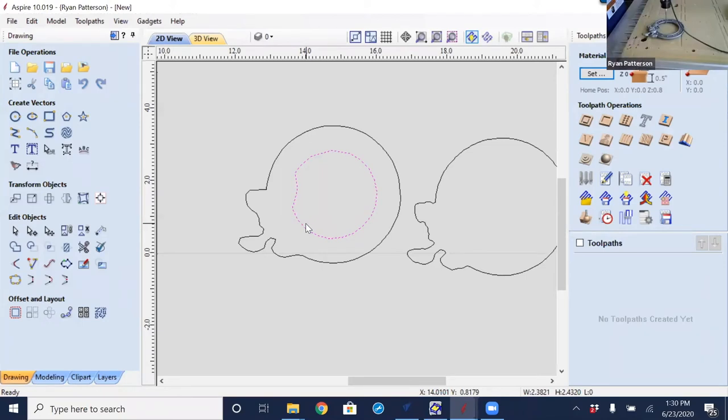So I'm going to have a value of 2.5 inches. Just to see where this is, 2.5 is right at the bottom of his foot here, and then over here is really right on the edge of this hole right there. The reason why I'm marking this out on the table is because it's also where I need to have the starting X and Y value, to make sure that when it scans, my value of 2.5, or really 1 7/8 that I'm entering in here, is going to make that full travel.